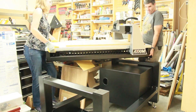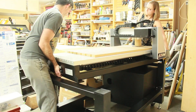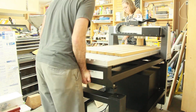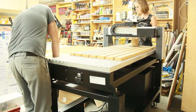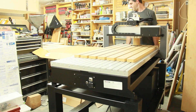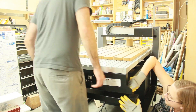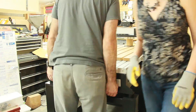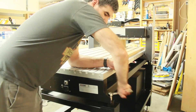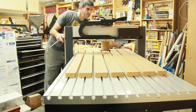This is probably the toughest part of the whole assembly process — this machine is extremely heavy. I was not going to be able to move this thing by myself, so my wife lent me a hand. What we did is I moved one corner at a time onto the base, and once we got it settled I'd lift up one side and let her get the bolt started. The bolt is a pretty long, solid bolt, and there is a rubber spacer that goes in between the machine and the base to keep out vibrations when you're using the machine.